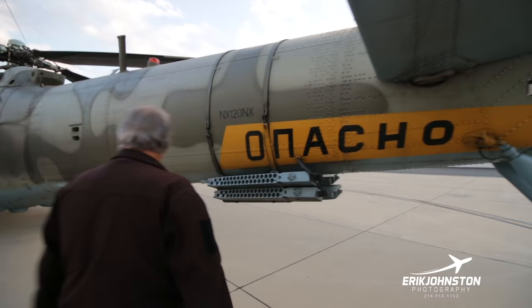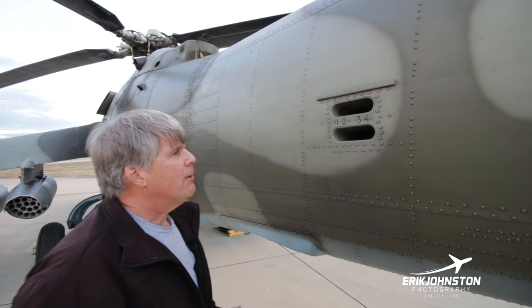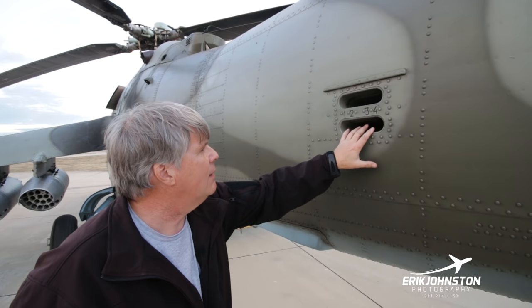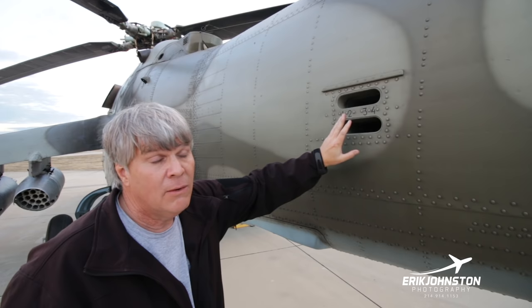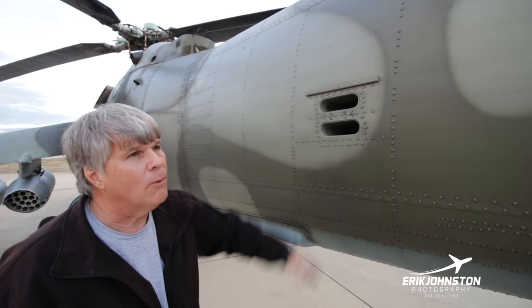These are the original flares that were in the aircraft, and these were just signal flares, kind of like what we put on our transponder, I guess, whenever we get to the airport and we don't have radio or we don't have something else. There's four colored flares in here, pretty much on all old Soviet aircraft. One indicates you don't have radio, one indicates you may have injuries on board, another indicates some other fire on board or something like that. So this is something to visually signal the tower as you're approaching home, to sort of get some help whenever you do land.